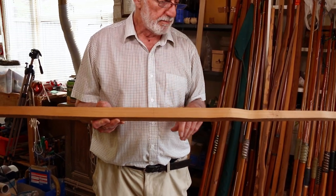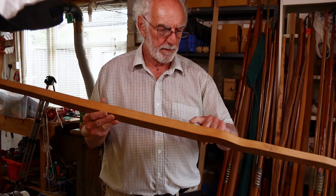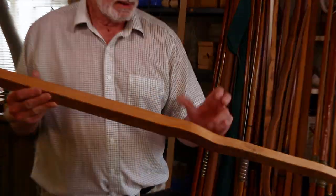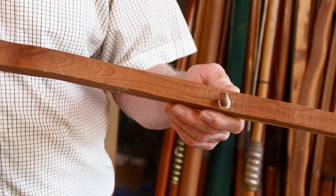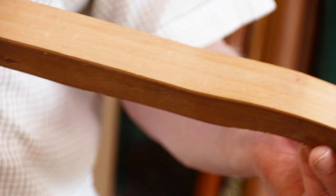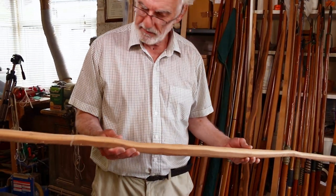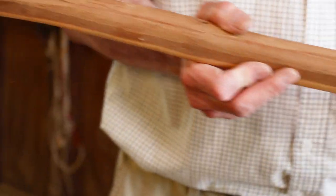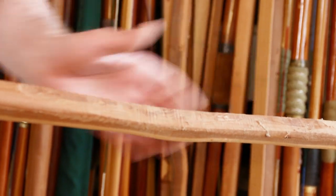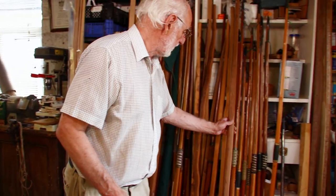That isn't a bow at all — it's one we've used for demonstrations when demonstrating bow making. I removed most of the sapwood on this because it wasn't very good and I followed the undulations of the wood, then glued a very thin layer of hickory to the back of it, clamping it to follow those undulations. There I've shown how to put in a Dutchman's plug. And that is going to be a self-yew bow — I'll never get around to finishing it. There were obviously problems with the wood and I've had to cut out a flaw there and a matching one at the other end. Eventually I'll glue in two pieces of yew and finish it off — otherwise it's a perfect piece of wood, just a couple of flaws you only discover when you've actually started making the bow.